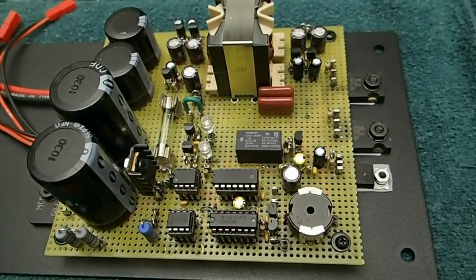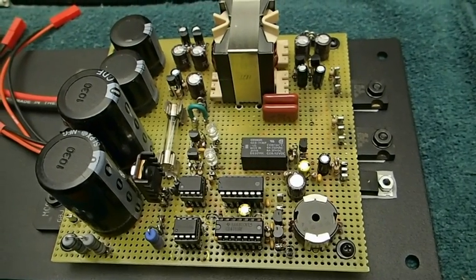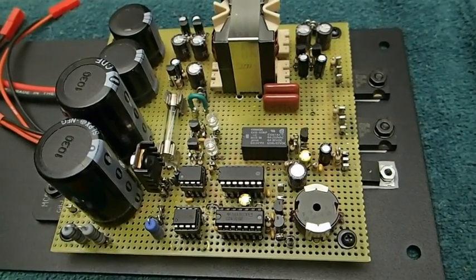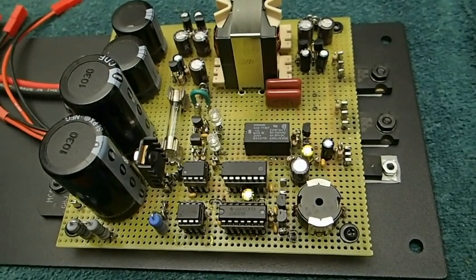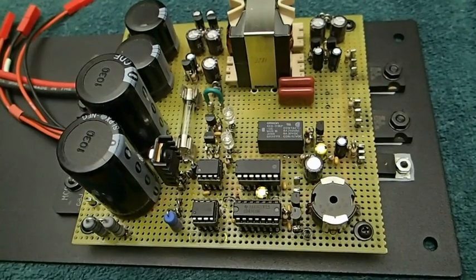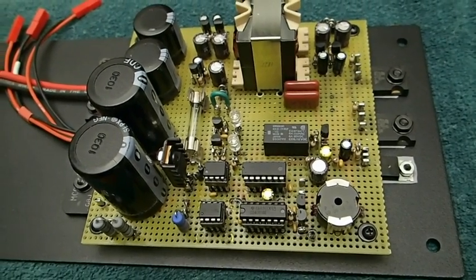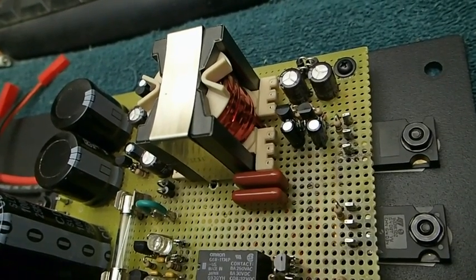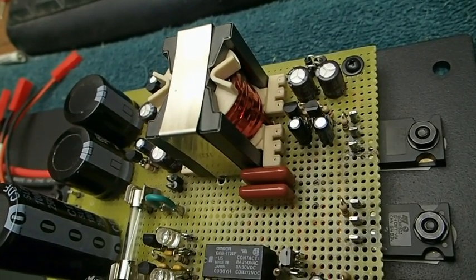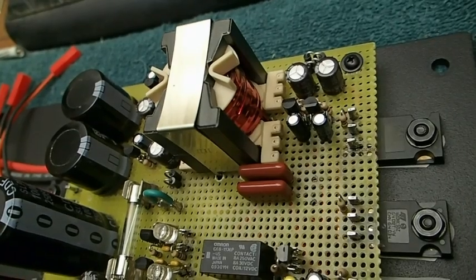What we have here is a close-up view of the circuitry. It's a digitally driven FET drive using a 555 timer, 4013 flip-flop, and a 4081 AND gate. Two MOSFETs driving this PQ535 transformer core. It has 20 turns on the primary and four turns on the secondary output.